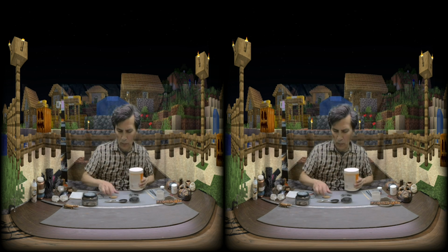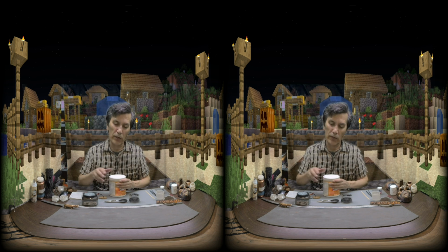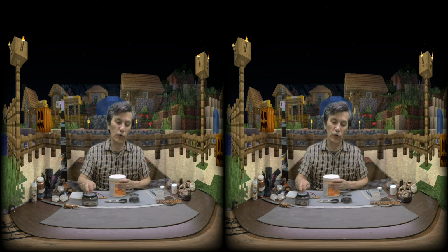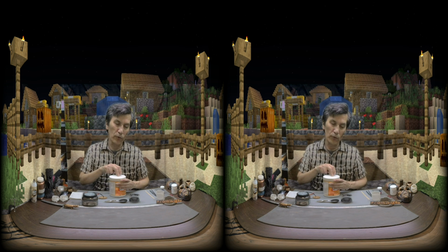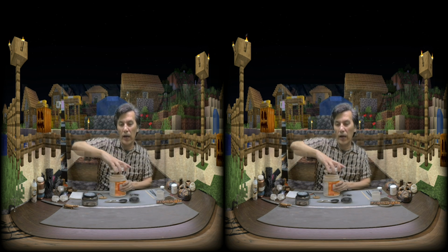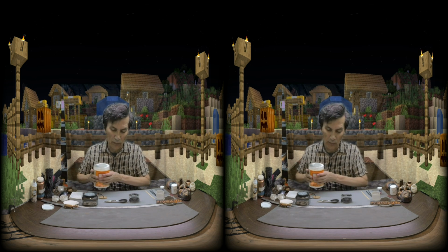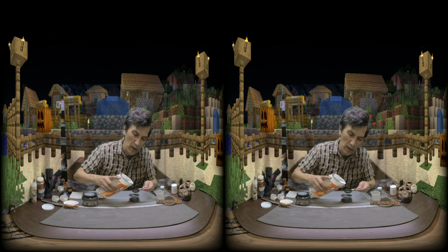Okay, Modge Podge. This is just a binder, a glue. You can use wood glue, you can use acrylic. How much of the powder you pack in will be determined by the binder you use. You can go almost 2-to-1 with this ratio, 2 graphite to 1 Mod Podge, but generally 1-to-1 works. I usually go 1+. So heaping tablespoons of graphite and level tablespoons of Modge Podge.